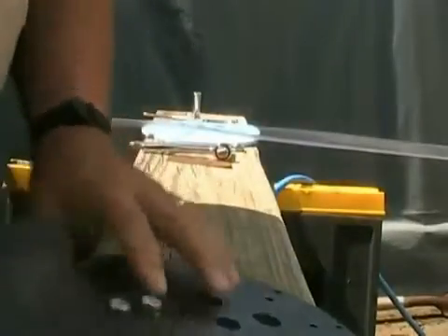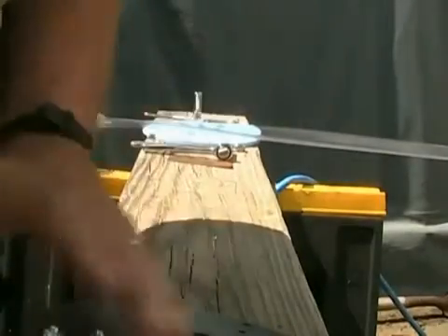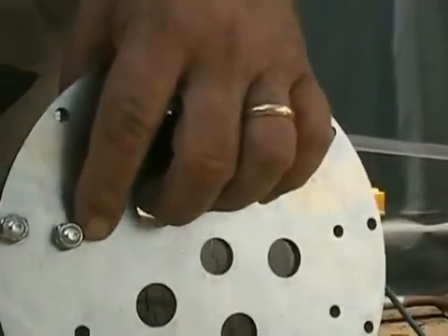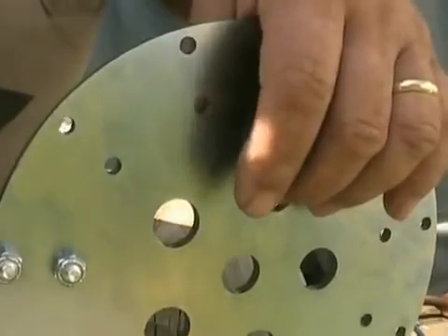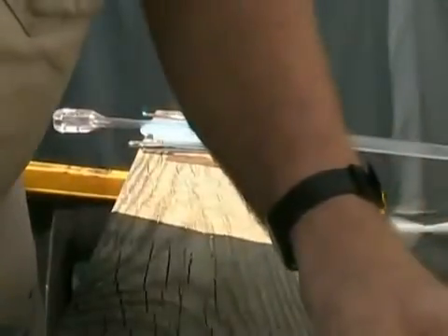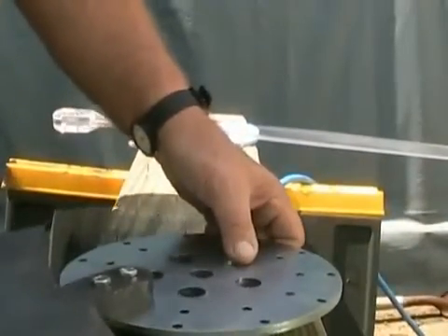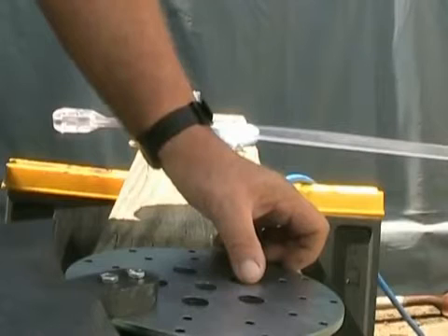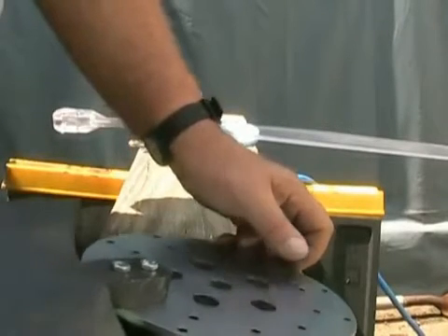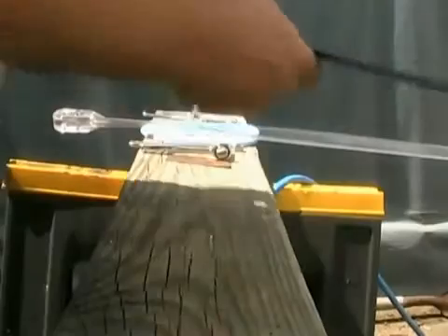Bolt it to your hub with the two bolts. Use the 7/16ths — two 7/16ths wrenches of any combination. Just don't over tighten them; snug them down. These are special aircraft-rated bolts and they use a fiber lock nut. If you break them, I would suggest you call the factory, but you can use a grade five if you want — it's not recommended though. Aircraft bolts are a little bit softer than a grade five; they'll flex a lot more and a lot longer. It's a characteristic of how the bolt's made so they don't break. You don't want these blades flying off.